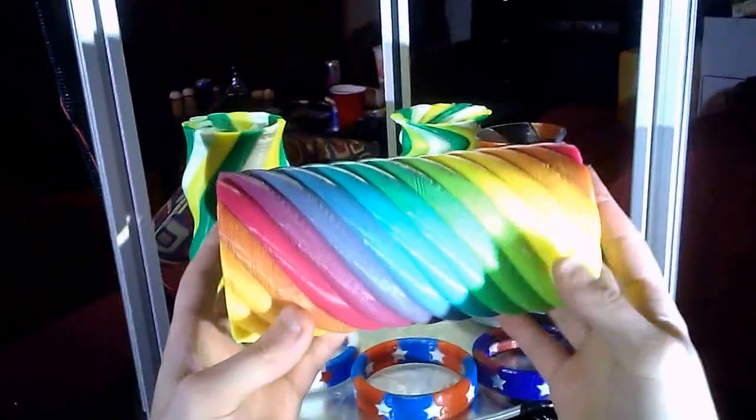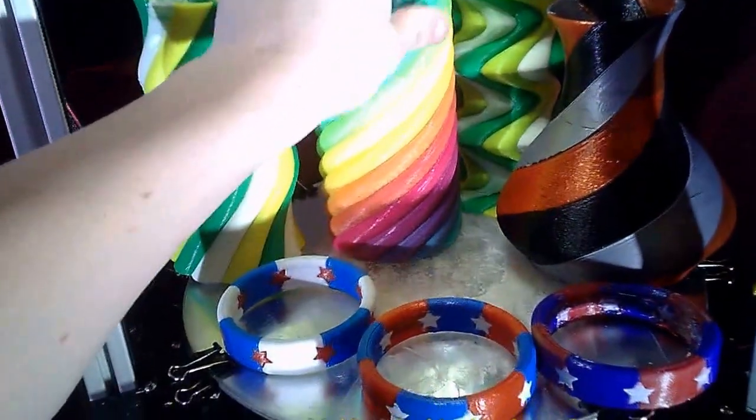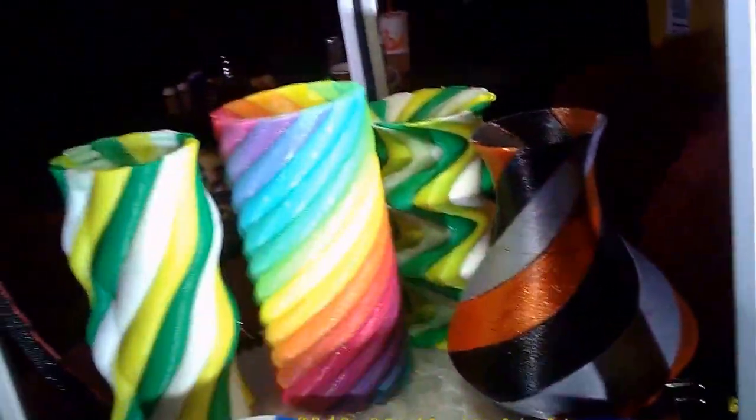Right now I've been working to put the diamond hotend in here. I designed everything that goes along with this. I got three extruders mounted and running. I'm doing full-color prints now with this, using magenta, cyan, and yellow — just like a normal printer would. I'm color mixing them to get up to 16 or even more unique colors, as well as solid colors.